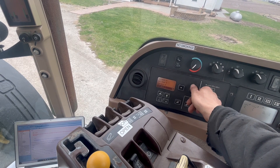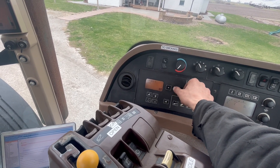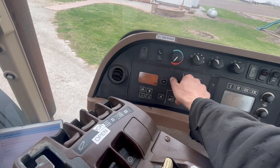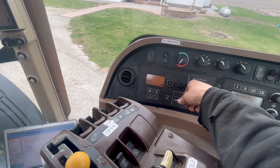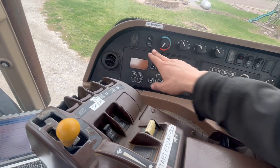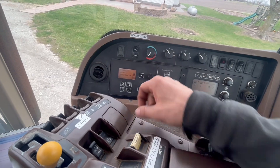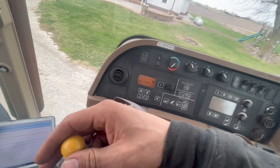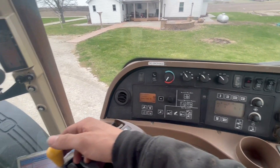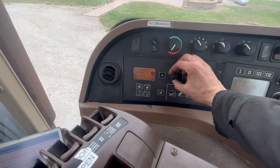Okay, here we go. We're going to go to address 24 — purge. Leave the tractor at a low idle, everything off: AC is off, everything off that we need to have off. We're going to start this here. Select gear four — oops, I put it in reverse for some reason. So go down to gear four and then we're going to go down to here.